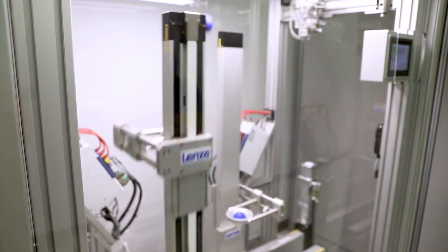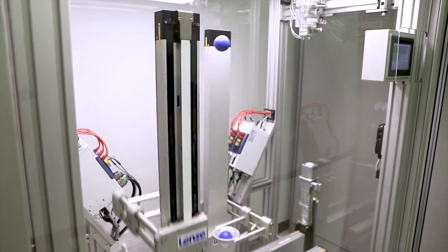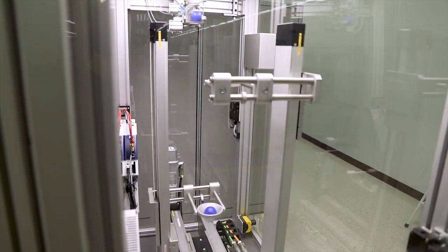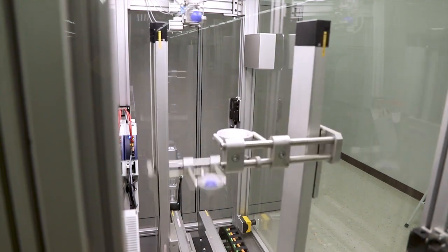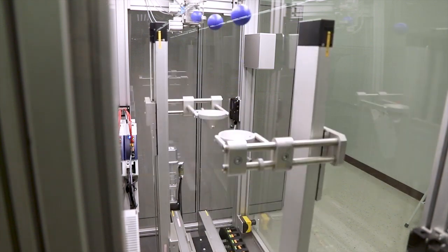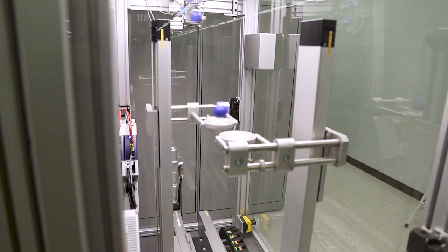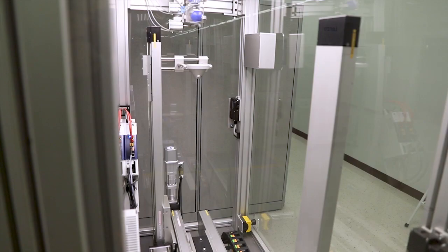What we are seeing in this video is the result of all 4 axes using the FlexCam fast module being synchronized with each other while stepping through predefined cam tables. Please notice the red Ethernet cables that are plugged into the i950 servos. These are the EtherCAT communication cables that pass information among the 4 axes. The juggler machine demonstrates LENZE servo technology to be extremely reliable and repeatable. Also, the juggler is one example of why LENZE's fast modules are proven and dependable.